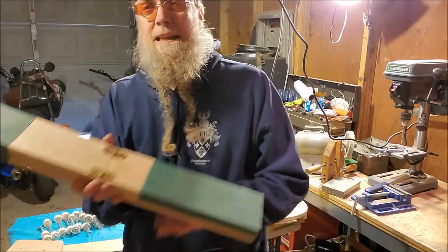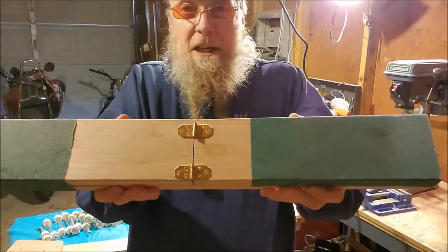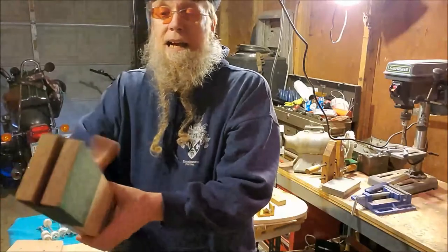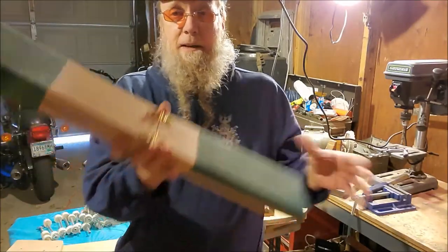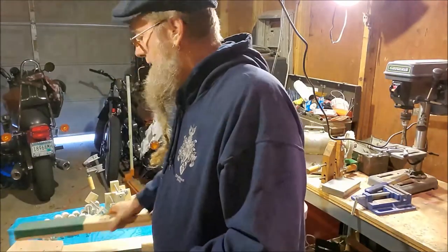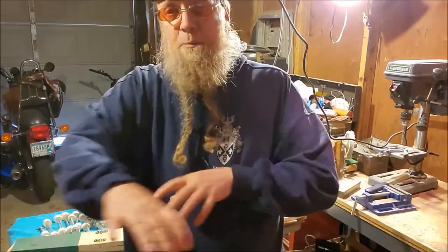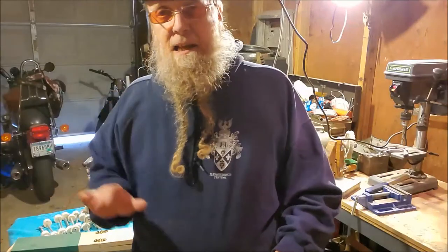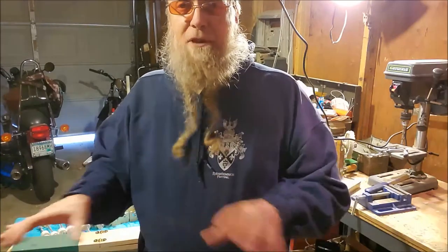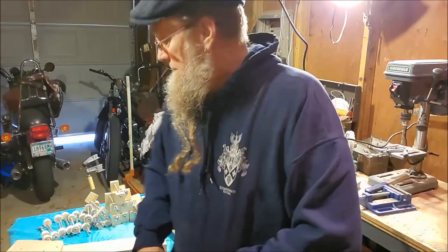Now, this is a very special sanding block. See, there's a hinge there. That's so I can adjust the height on this piece right here. That way I got a 5-degree angle. Because once I had the sides all glued together and in a shape, I had to put a radius on it because the back has a bend and a curve going both ways, like this and like this. So I needed that 5-degree radius. So I needed something so I could sand along on that.